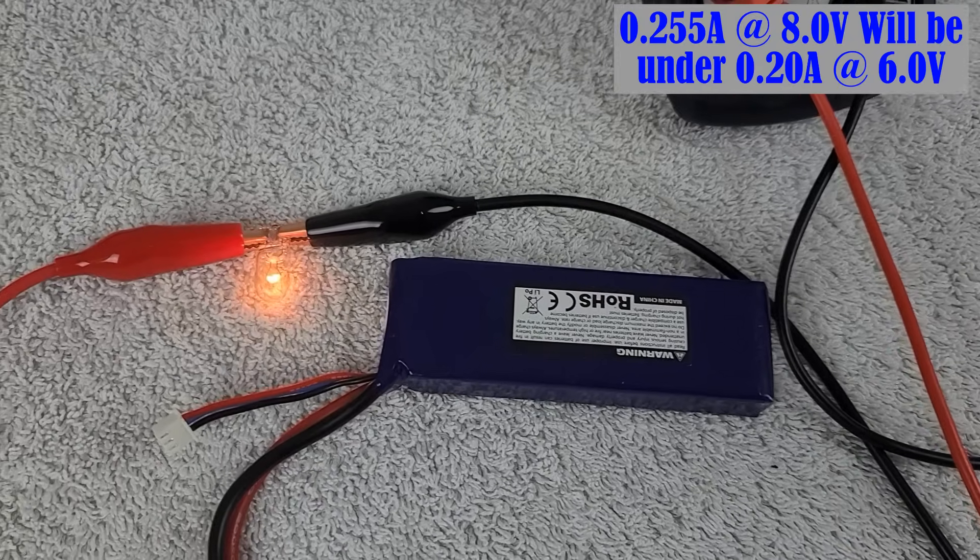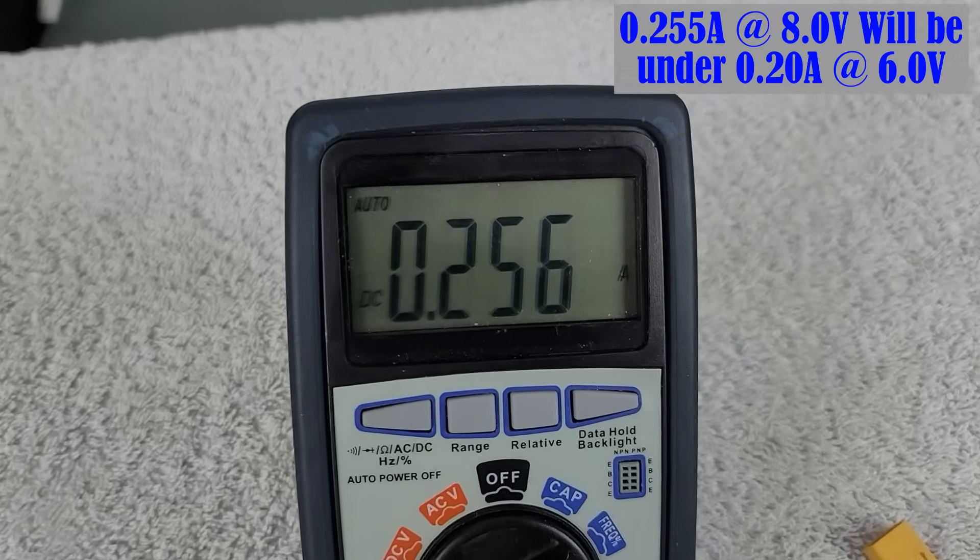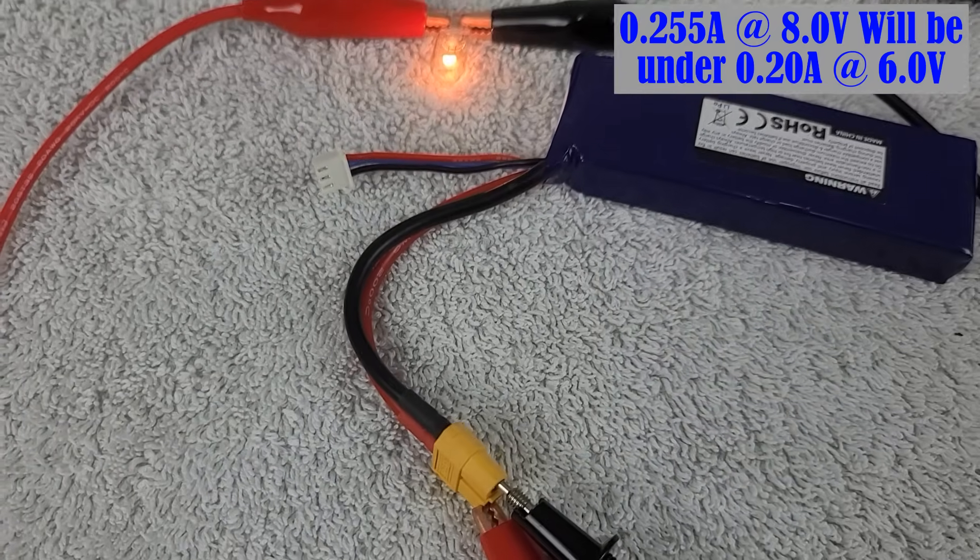When it comes to our water solution, there are a couple advantages and disadvantages. The advantage is it's quite easy — there's nothing really to worry about and it's probably one of the safest ways to discharge a battery pack. The disadvantage is that it's going to take a very long time — you're probably looking at having that battery pack in the solution for at least two to three weeks, and at the end you'd be lucky to have it hit 0.00 volts. There are also other clever ways to discharge the pack once you've brought it down to 3.00 volts per cell, such as wiring a light bulb with a connector to your battery pack. The only thing to make certain of is that the load pulls less than about 100 to 200 milliamps, because heat builds up very quickly when you get below that 3.00 volt threshold.